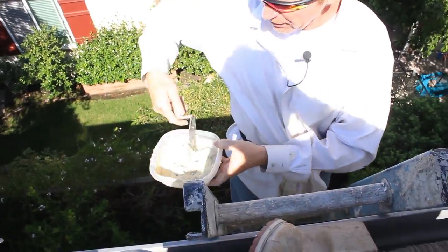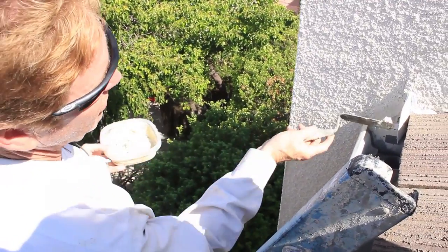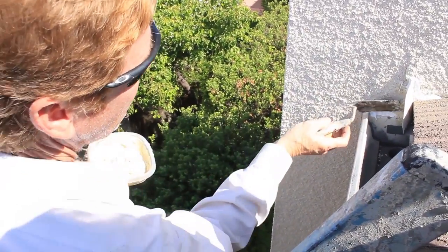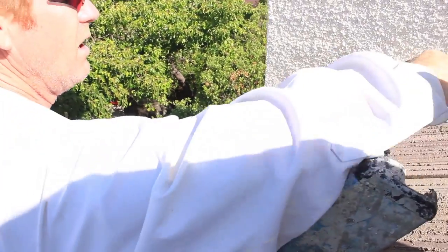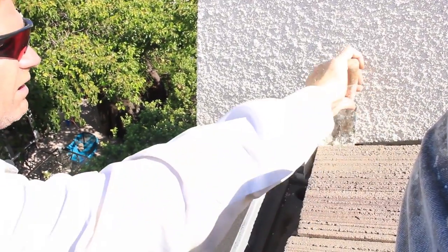What I'm gonna do is put a little bit of stucco over it now. It took me longer to match this finish than to actually do this patch. I'm just gonna put this directly over the polyurethane caulking — and that's only because the caulking will last a good 50 years, but with a little cementitious finish over it, it's not gonna hurt.